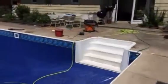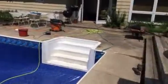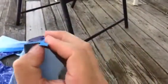Here is the pool liner — this is the top, this light blue. Underneath that white pipe-looking thing is just coping — it doesn't do anything other than cover the edge of the concrete. There's a little metal track underneath that — a little metal lip. You shove the liner into that little slot and then it hooks and won't come back out. It's that simple — like literally just shoving it into the cracks of deck boards. You just shove it in there and it snaps in pretty good.